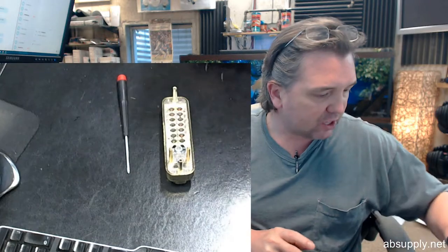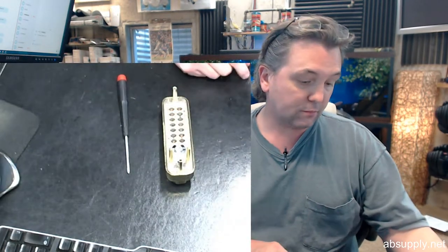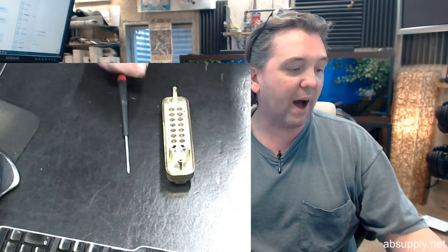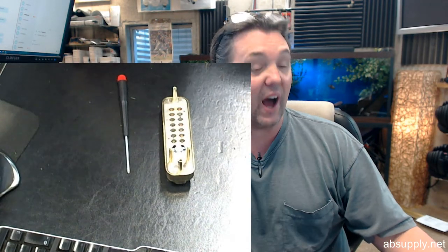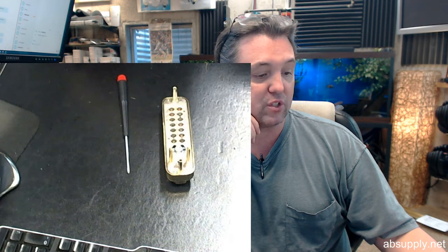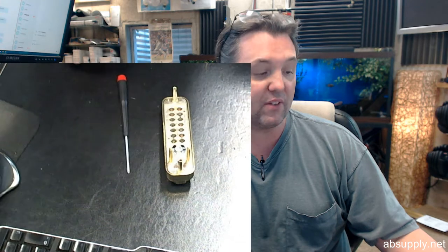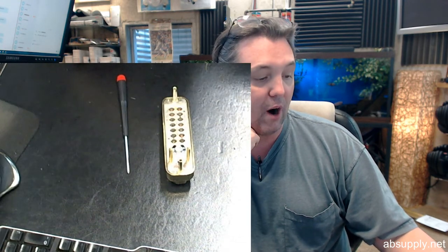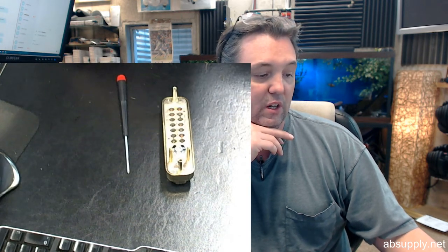So, per the installation instructions, page 2 is where we are right now, step 3: on the lock body with 14 wafer holes, 5 red marked wafers are identified digits for the unlocking codes, preceded by the C button. 8 blue marked wafers are neutral codes. 1 plain wafer is clear 1 for restoring numbers to free position.